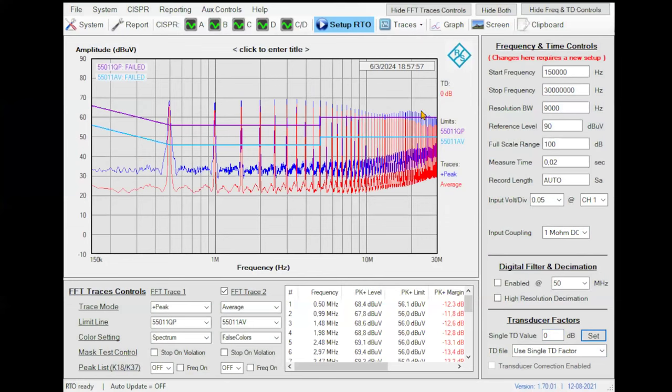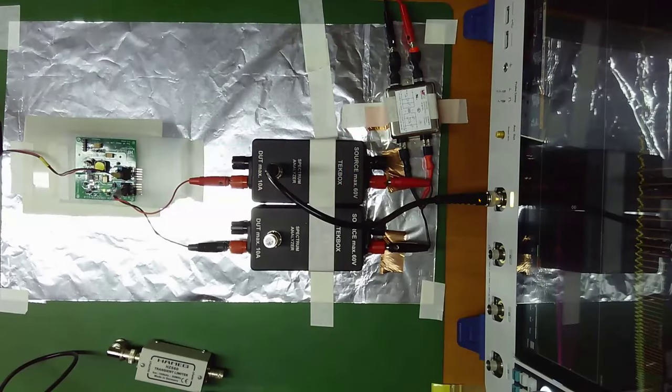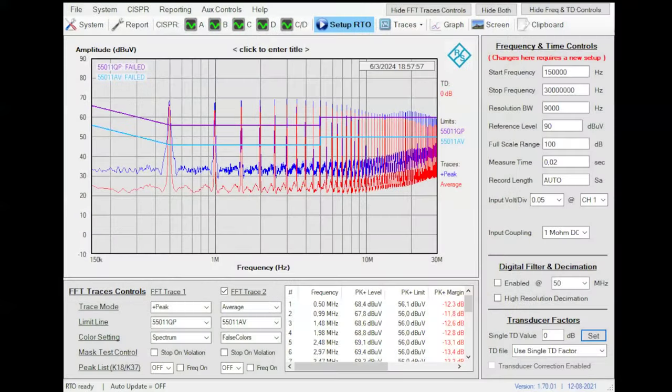the amplitude. If I increase the length of the cable, if this cable, instead of 20 centimeters, is, for example, 1 meter or 2 meters, this mountain effect increases a lot. And this is because we are creating reflected signals in the transmission line. So remember, 50 ohms is the input impedance of the oscilloscope, and introduce here the transducer factor of the transient limiter or any other element you are interested in introducing in the middle of the signal.